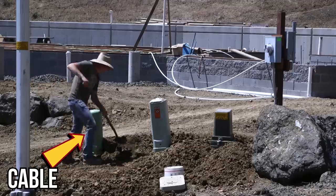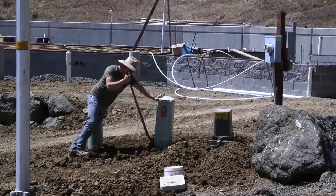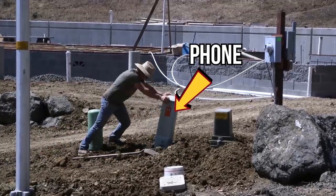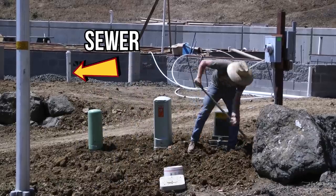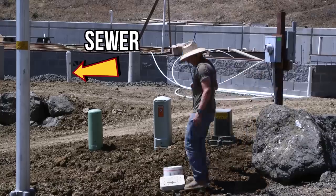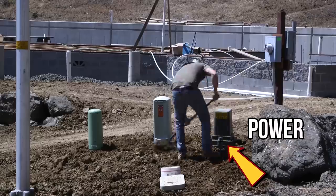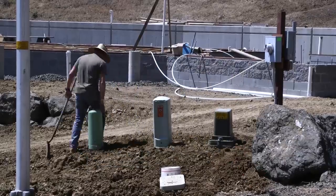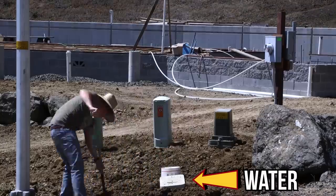Welcome back. For this house, for the time being, we're done with the utility work in the crawl space. We've done the sewer, water, and HVAC ducting. Later, we will need to put in a small amount of natural gas. The big thing that will be done in our crawl space is the insulation. It'll be placed and pushed and secured into the cells between the I-joists, but that needs to wait until the house has walls and a roof.